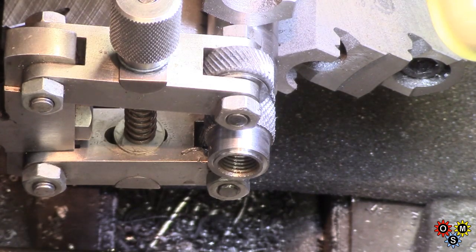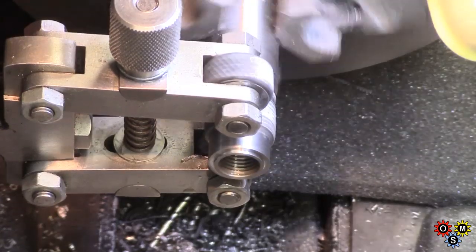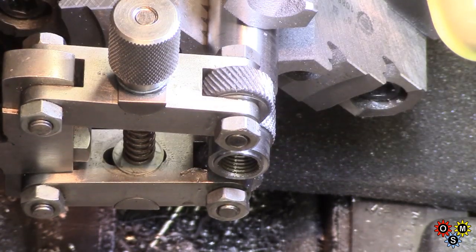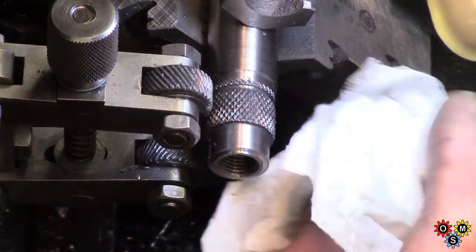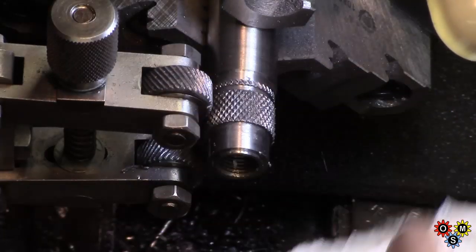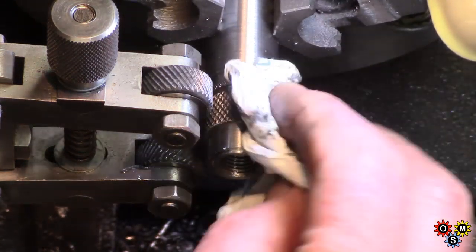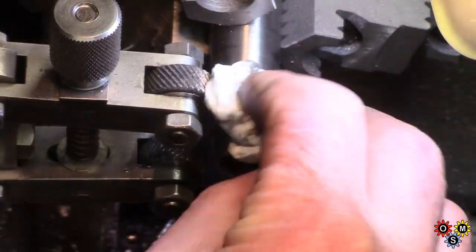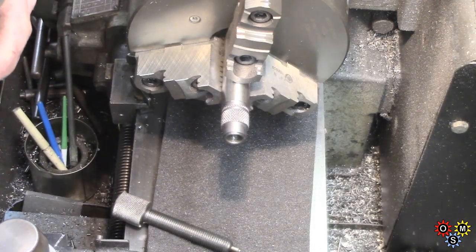Last pass on here. I have a hell of a job seeing what I'm doing because it's small diameter material, but we're gradually picking up on it. I think that'll probably suffice. I think we're okay on that. I was using the spindle handle, which I usually do when I'm knurling, particularly on a small area. So this just needs cleaned up and wire brushed. Yeah, it's deep enough.